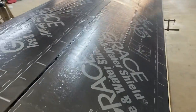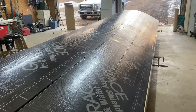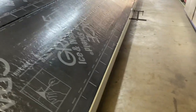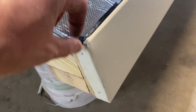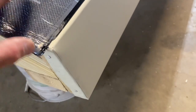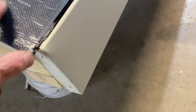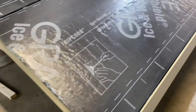It's kind of hard working on a bow like that, having this arch, trying to keep the roll from rolling down the hill. Kind of tough, but we got our fascia on there, and that's what I was talking about earlier. You want this over it, so any water that leaks under the steel or condensation or anything will run down over. You wouldn't want to put this over, because this is more like a drip edge than a fascia. It's kind of how I had it bent up.